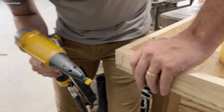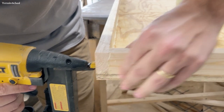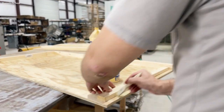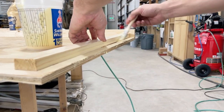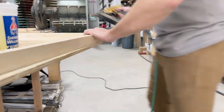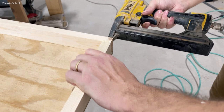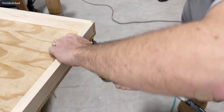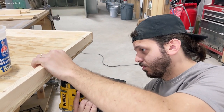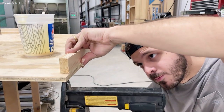Laying out the piece next to where it goes allows me to brush both sides at the same time. Then I'm just going to tack it down with the staple gun. The glue is ultimately what holds these boards together. If you don't have a staple gun that's totally okay — you could use screws, weight, or tape. Just hold it down. The staples are just there to let the glue dry and form the actual bond. I'm using my thumb here to feel the edges of the pieces and then moving it out of the way when the staple goes off, which makes a nice flush surface all the way down.